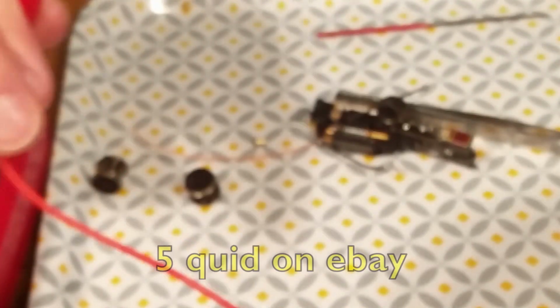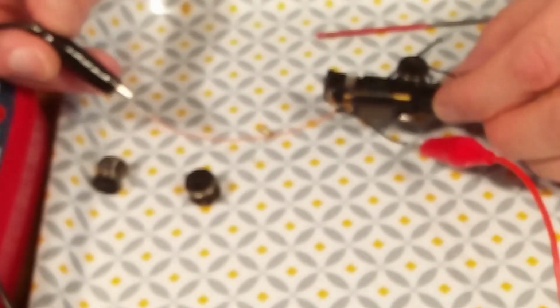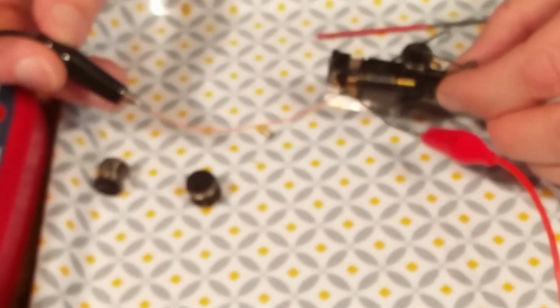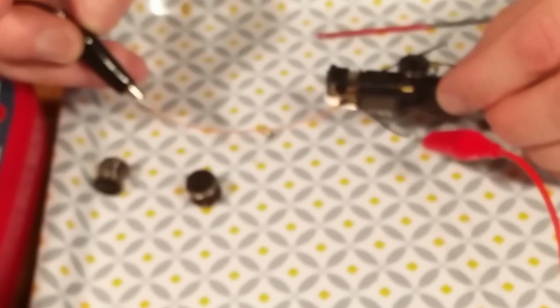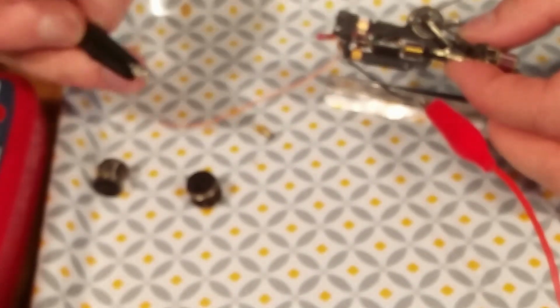So I've got here my dodgy DC power controller, and I can attach one end to here, which is connected to one of the brushes. I've just got to move the wheel away from the motor, and there I see the motor spins nicely. That's very pleasing. Lots of sparks between the brushes and the commutator. Perhaps that's what's supposed to happen. Perhaps you can see that. Very nice.